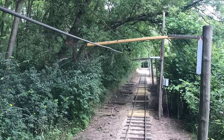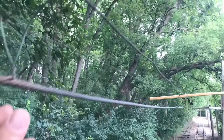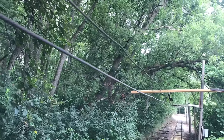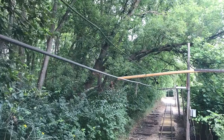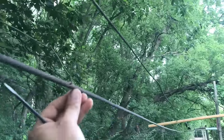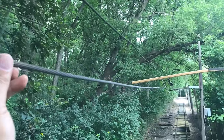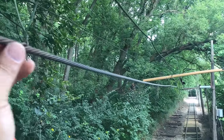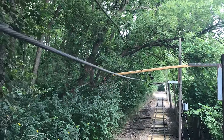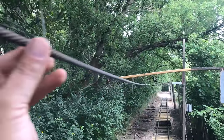The biggest thing is the messenger wires keep the wire from swinging side to side as you're going down the track. Without enough tension on your messengers the wire will get to whipping and throw the pole off. The messengers also keep the wire from rotating, so when the shoe passes through it stays straight and keeps from going side to side.